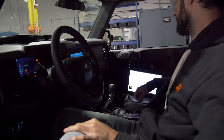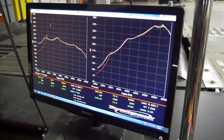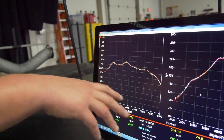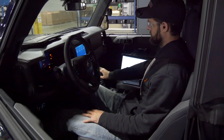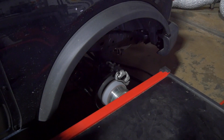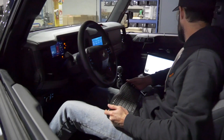Power is back up, bottom end power and torque is back up. It's nice that we're seeing a little bit of improvement — especially having just put this part on the vehicle and running it now. As the car starts getting used to it we might see that change, maybe pick up a little bit more. Speed density cars — honestly it might start making adjustments and kind of pull itself back down and run over that same line. But we're testing it to see what we're going to do.